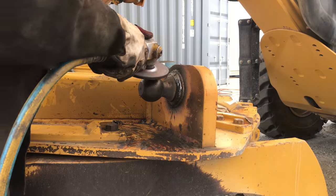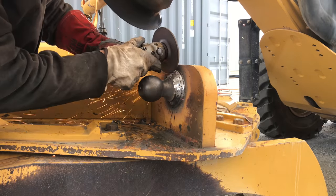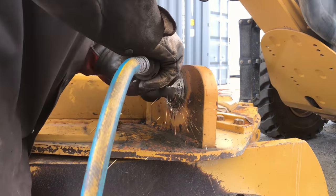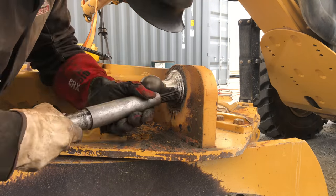Now that I've got those welded, I'm just going to go through and take the tops down off the welds and remove any weld spatter. I'll be using a standard angle grinder for that. For the hard to reach places, I have a long series 4-inch grinder, which is really good for getting into some of those really tight spots. And then after that, I'll follow up with a needle gun that'll re-texturize the weld joint and offer a little bit of stress relief.